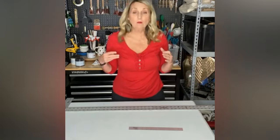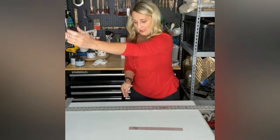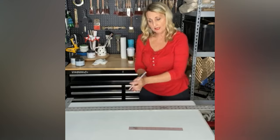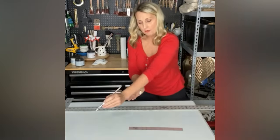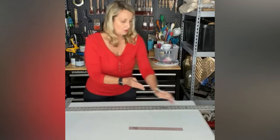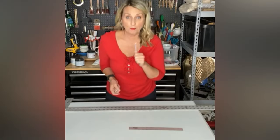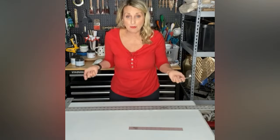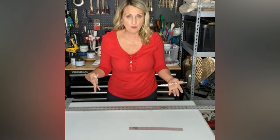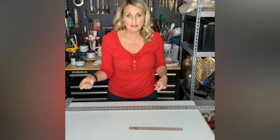So eventually, after I've made all my 5 inch wide marks, if you turn sideways, you can see a row that's perfectly straight. And I'll lay my ruler across that and draw out my lines from side to side at an angle, going this way across, and then I'll take it this way and do all my little dots at an angle just that way going across. You can either draw it out with a pencil or you can just go ahead and tape it off. You don't have to draw the line if you don't want to. If you're painting by hand without tape, draw your lines. If you are a taper and you want to tape off your Harlequin, that's how you would tape it off.